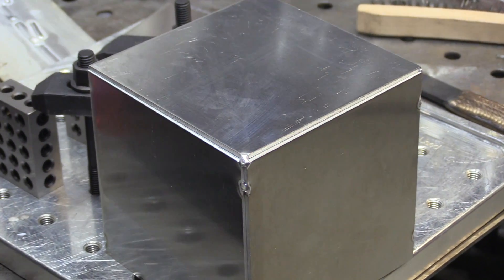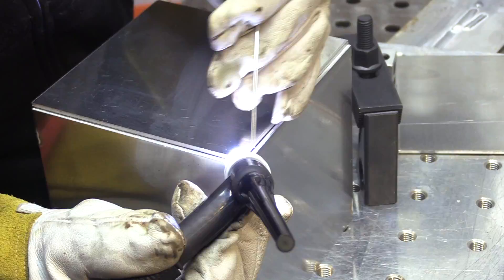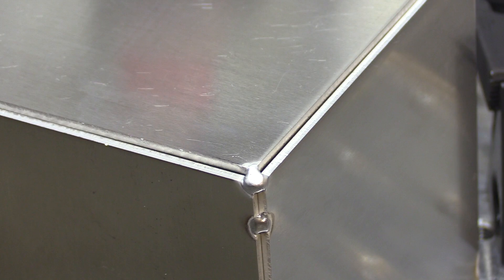Here's a close-up of the tack weld and the arc start with that tapered electrode — it lights up pretty crisp, still wants to wander just a little bit, but I get a few dabs in there and taper off as I swirl to not leave a crater hole. What I really want is some tacks on the corners and then also maybe a small tack inboard an inch or so, so that when I light up on the corner tack, if there's any stress on everything it won't pop loose and leave a gap.